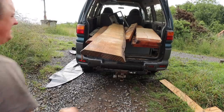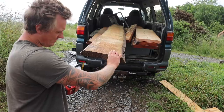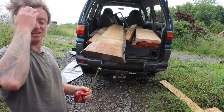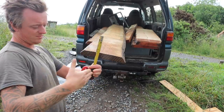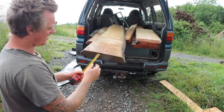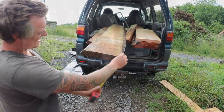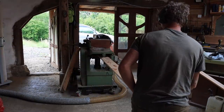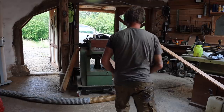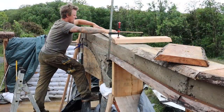Anyway, because of the problem with the concrete not setting as hard as I was expecting, I decided to add an inch and a half timber wall plate to the top as well, and sandwich everything together with that. Concrete's got poor tensile strength, and because it isn't as strong as I'd like it, the wood with high tensile strength is going to add a lot of support, particularly in the direction that I want it. And then I'm going to make a glue lamination board to go over the archway as well. I'm just going to run materials through the planer thicknesser and then glue them together in an arch, and that will add support over the arch that we can put the roof timber on.